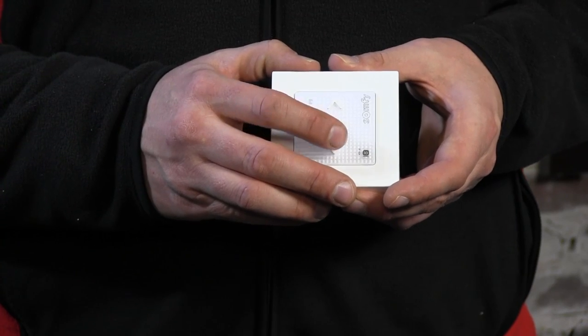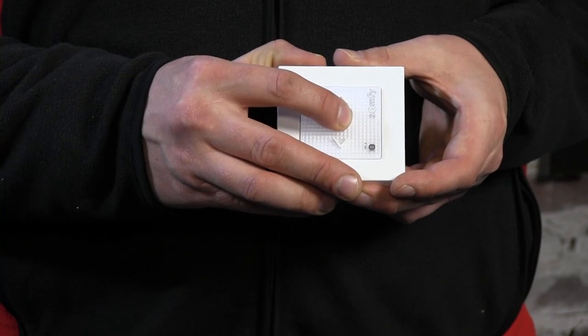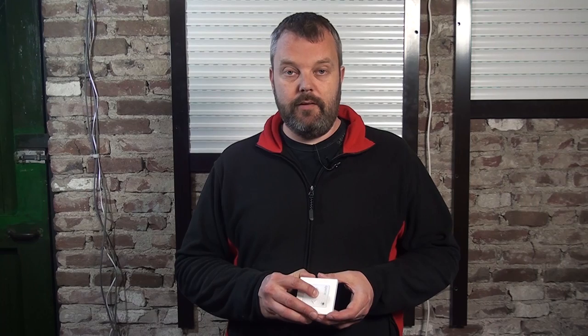So now when I press down it goes up and when I press up it goes down. I'll change that again by pressing the my button and holding it until the motor responds. It goes down — that's been corrected. You need to do this at this moment in the programming procedure, because if you try to do it later it will no longer work and you'll need to reset the motor completely. So to prevent that, we do it now.